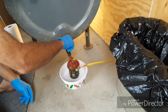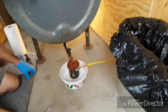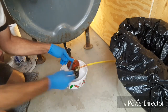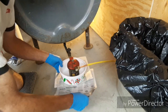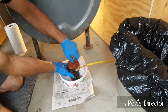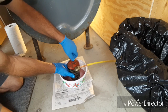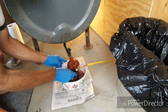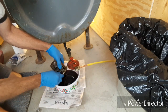What that valve is for: if there's a fire, it will separate from the nut and close the valve. Once you've done that, I usually turn it upside down just so I know, and keep it right there. Then take your 5/8 wrench and go ahead and loosen that up. I'll put my newspaper on me just in case anything splatters. Pull that bolt right out of there and set it on the newspaper, then empty the canister out.